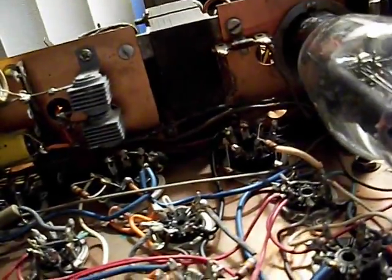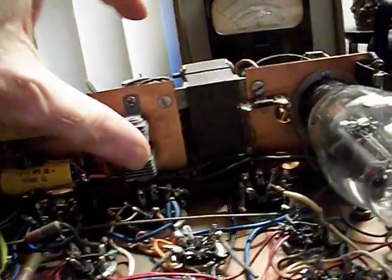I've got some electrolytics here — three of them. I'm not sure how this thing's configured, but it's probably a full-wave rectifier, and those are probably going to be the same value whatever they are. So I'll have to deal with that. I'll leave the seleniums alone for now.